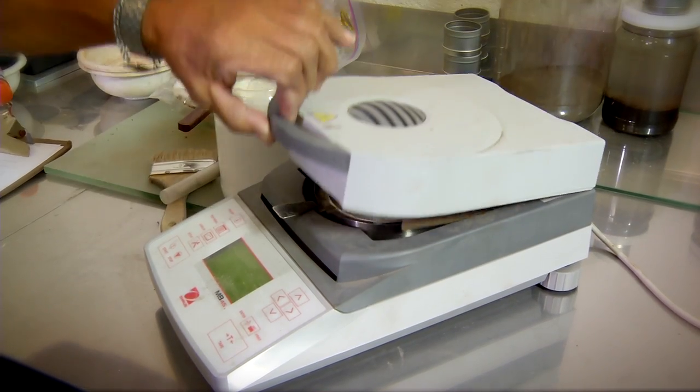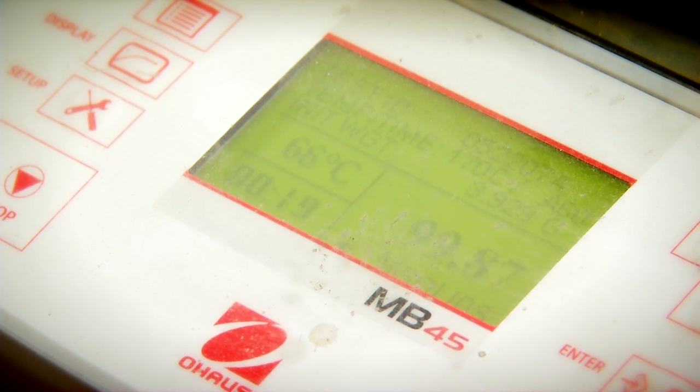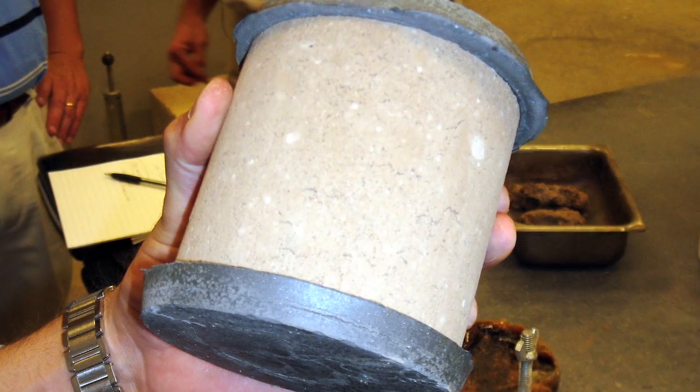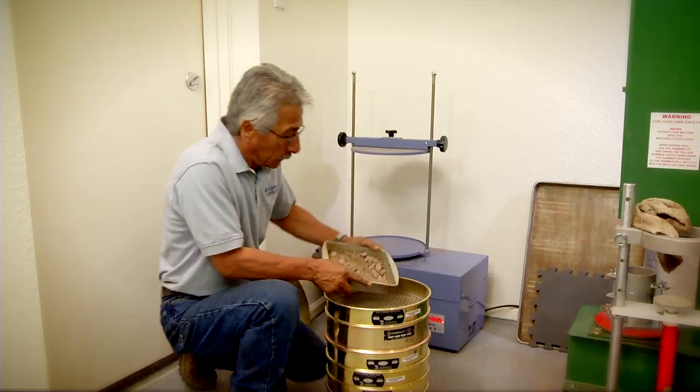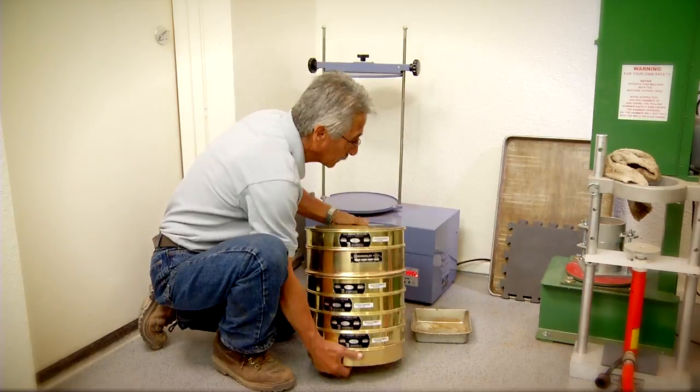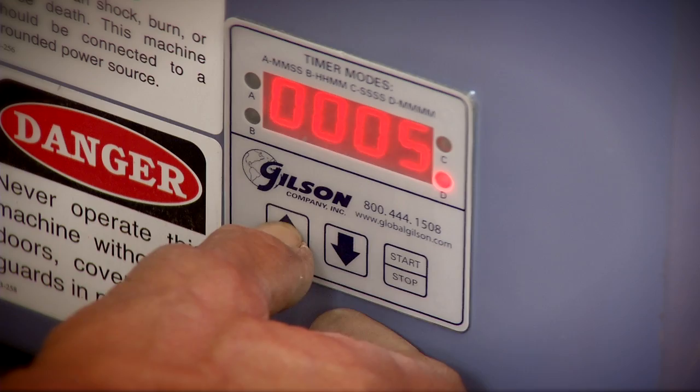In our laboratory, we're taking the different types of soils that we'll be working with on site, and we're basically making the same product in the laboratory, testing its strength, all of its different properties to optimize our results. And then once we decide what's an optimal result we're looking for, we use those application rates, and we repeat that in the field on a larger scale.